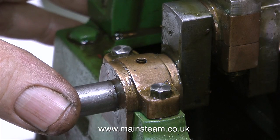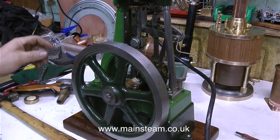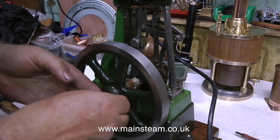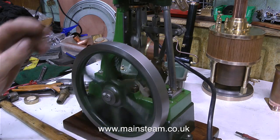This is nothing more than a gratuitous shot of one of the main bearings, to remind me that they both need a little bit of attention — both of them are quite slack, so I'll be taking care of this in the next episode. I'm more concerned with the flywheel at the moment. I've refitted it and it's running slightly more true than it was. And here's the original key, which is a real rattle fit — no good at all. I'm going to make another one.